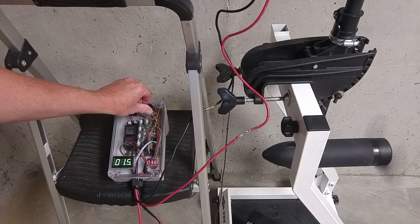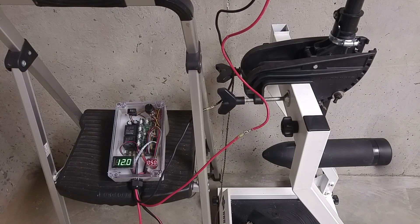I'm going to take it up to about 50%. There you have the reading — 50% power output. It's reading 12.0 volts and the flashing 2.1 amps being drawn by the motor. This little box is really good if you want to figure out exactly how much amps and power your trolling motor is pulling, which will let you have a better idea how long your battery is going to last. It looks like it's working pretty good and it will be much easier to do testing out in the field than using a separate device to read the amps drawn by the motor.